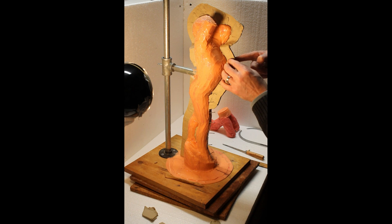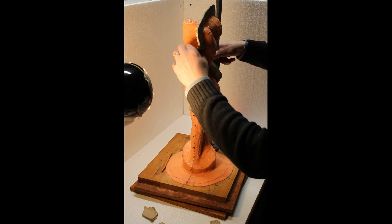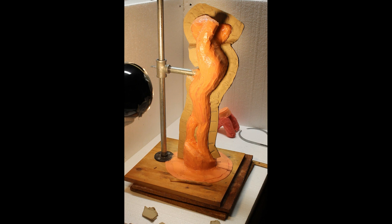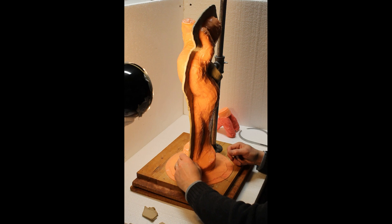I'm just finishing up here, bringing this wall down. You can see how I curve the clay and pinch it. When I get it close to the silicone, I give it a little squeeze, which draws it in closer and closes off the gap. When I'm done, I'll take my wooden tool — wooden knife — and smooth that clay wall up to the form. In essence, what we're doing is creating a shim so that as we build up the plaster and apply the bandages, we're creating the two halves, and this is how they'll be bolted together.